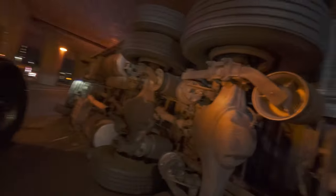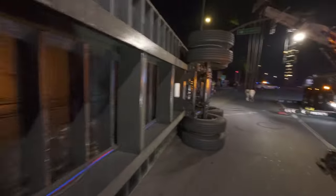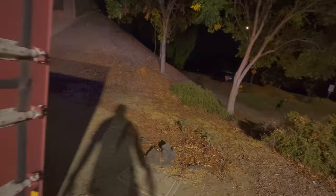What I'm gonna do for the first maneuver is pretty much do a deadlift and swing it over where I can get under this pocket here, where I get enough boom height to be able to do the maneuver safely without risking running out of cable. So we're gonna have to slide this over to connect one of our container links down to the bottom. So connect another one there and pull it.